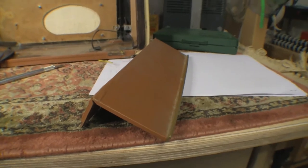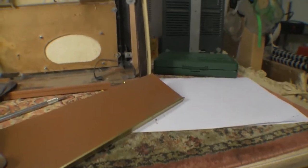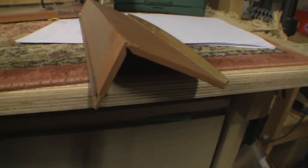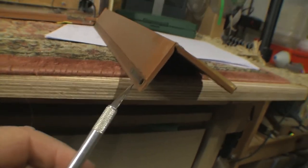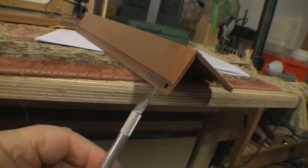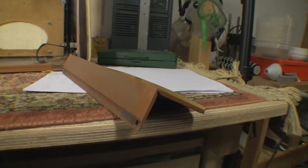This is that flap that pulls down over the controls and the dial cord and the glass dial. I was wondering how I'd get it out, but it turns out you can see this little lip here which catches, but it's actually just a piece of spring steel on this side. So by sticking the X-Acto knife blade under it, pressing it up, I was able to pull it past the stop. And so now the front case should come off fairly easily.